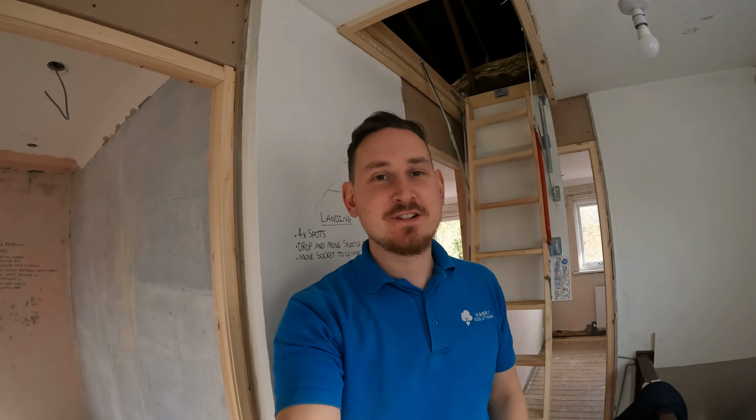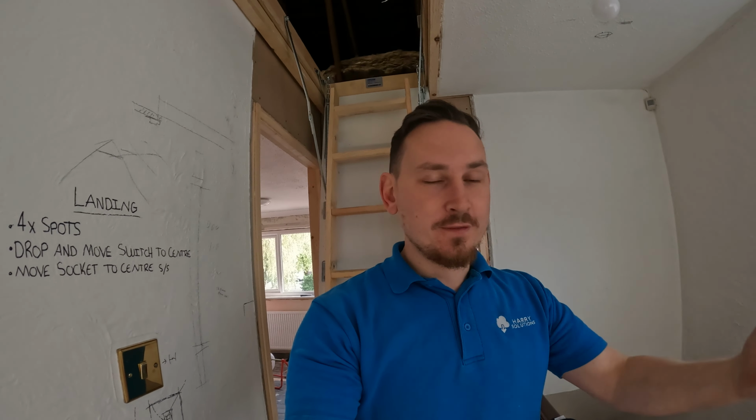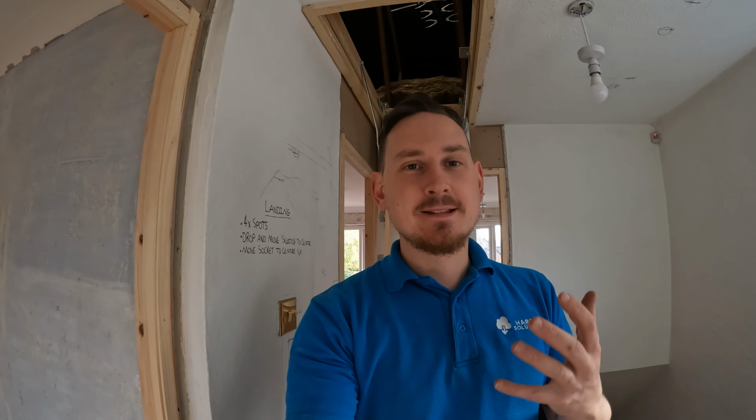When a house is undergoing renovations, it's a perfect time to install CCTV or Wi-Fi or internet into points of the house where it's weak, because while you've got all the flooring up and you've got the house stripped back to bare bones, it just makes perfect sense to run the cables in then. Best time to have this done is when the electrics is being first fixed and the plasterboard hasn't started being put on the walls. So just as you're getting first fix electrics all sorted, get your camera cables running, get your internet feeds running, so that way when it's all plastered and painted, even if you never use those cables, it's always great to have them and know that they're under the floor somewhere and you're not having to chase walls out in the future.